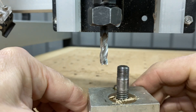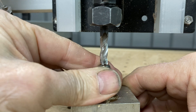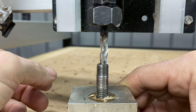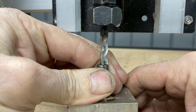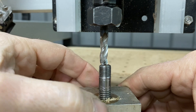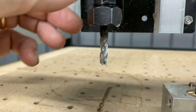Bring in your adjustable gauge block and turn it up until it's snug. You want to feel it out — you can hear it's rubbing up against it. Take it up to there, then back it off maybe a quarter turn or an eighth turn. You don't want it too tight, and I'll show you why in a second. Once you get it the way you want it, pull that out.